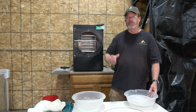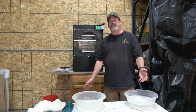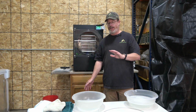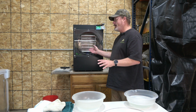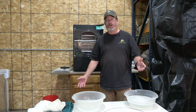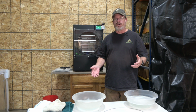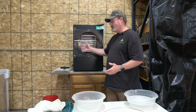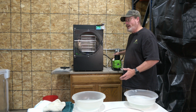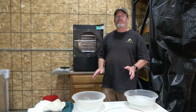And I have some water with what is called a mild detergent. You'll see all kinds of folks going into all kinds of different things, and I guess I just went with dish soap. I consider that to be a mild detergent. I've seen some using vinegar, and I cringe when I see that, because stainless and vinegar don't like each other. So I would keep vinegar out of there. You're not supposed to run vinegar through the machine. You're not supposed to freeze dry dill pickles that have a whole bunch of vinegar in them, because it can pit the stainless steel, and it can mix with the oil in your vacuum pump and literally create an acid and ruin your pump. So I would stay away from using vinegar.